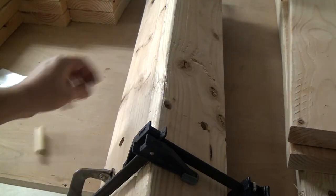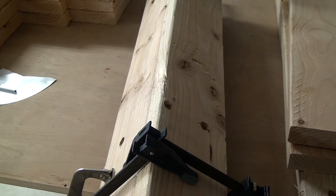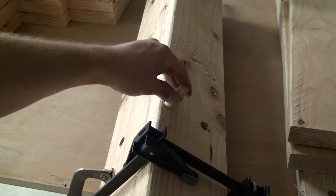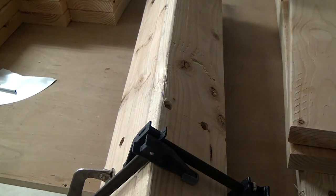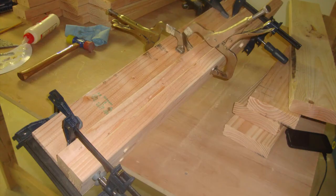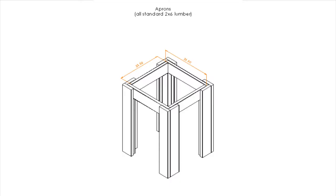You can see where I've glued holes for the dowels. Dowel construction is a lot more complicated than regular construction because you have to clamp the whole thing together to drill your dowel holes, then take it all apart to glue it, then put it back together, glue your dowels, and hammer them in. So don't be intimidated — but honestly, if I were doing this again I'd probably just use screws. You can see the 2x4s for the legs on the left, the 2x6s on the right, then four boards in the middle for the aprons, and four more for a lower structure. It ended up being so rigid I just didn't need it.